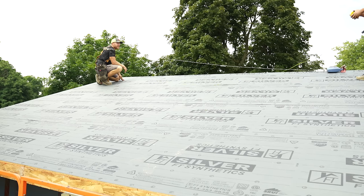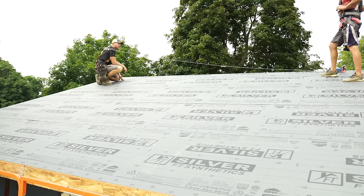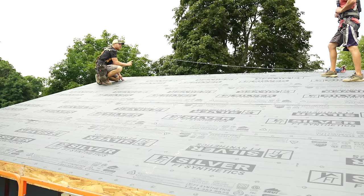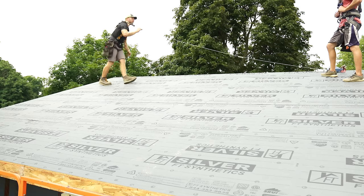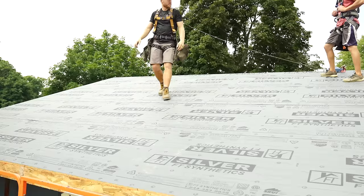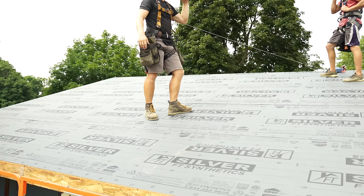We'll just move the bottom over like a 16th on the last two sheets, and then we'll be exactly where we want to be. So 76 is divisible by 4 foot exactly, which means that's 19 times 3. It's 57 sheets. So we have 57 fulls, or in this case, 56 fulls, and then 2 8.5 inches on each end. For one side? For one side, 8.5 inches on each end. Because 76 foot is exactly 57 sheets. See what I'm saying? But we don't start with an exact because we can't bend it up. So we're gonna do an 8.5 and an 8.5 on each end.